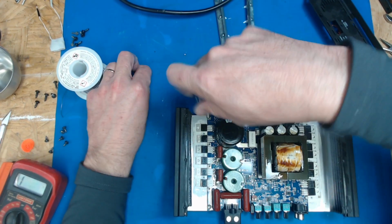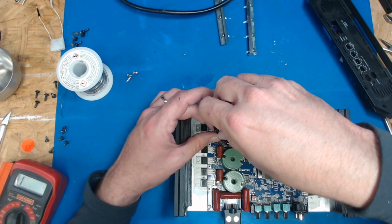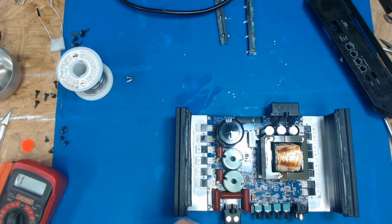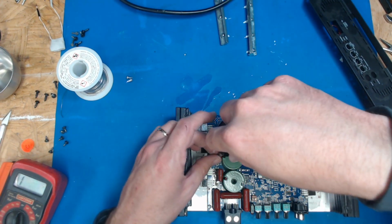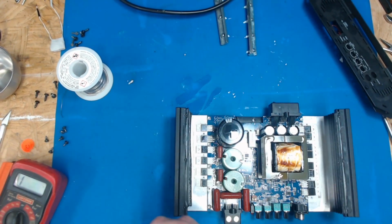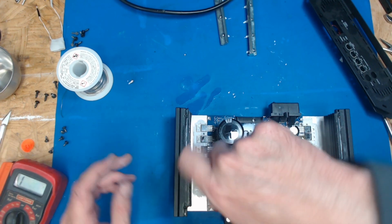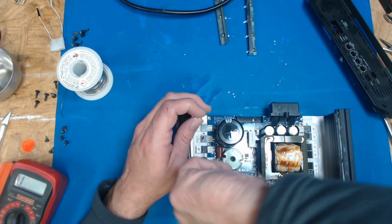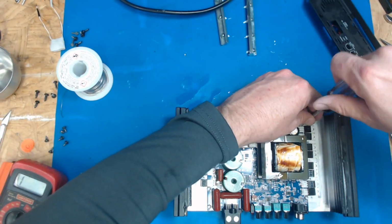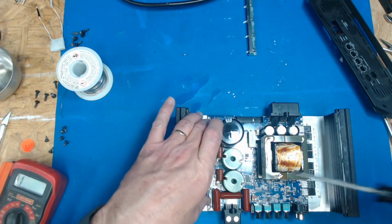And I don't want to be the guy to tear up the holes, because this amp may last another 10 years if it's okay, or maybe another year, or who knows, depending on the abuse it sees, and somebody else may have to get in here and work on it. They may blow something the next time. Of course, it may be blown now. We don't know yet. None of the FETs tested shorted. Definitely had come apart on its solder of its power connection, so somebody was pulling a hell of a lot of current. Might have been enough to kill it, you never know.